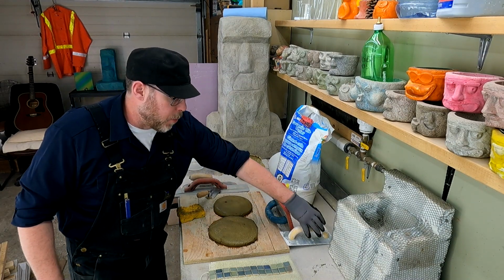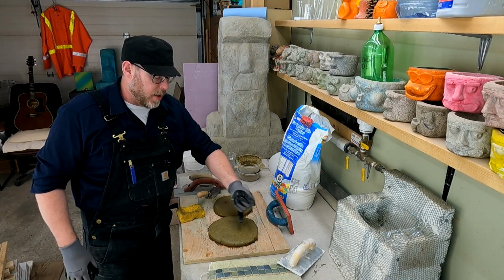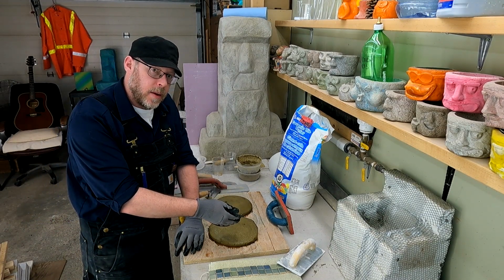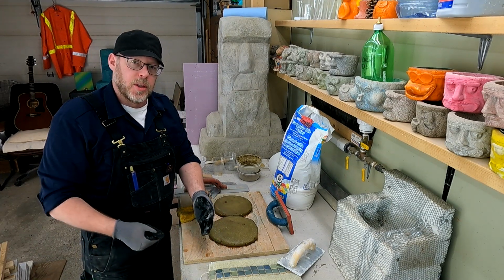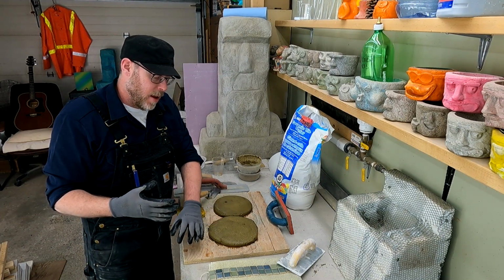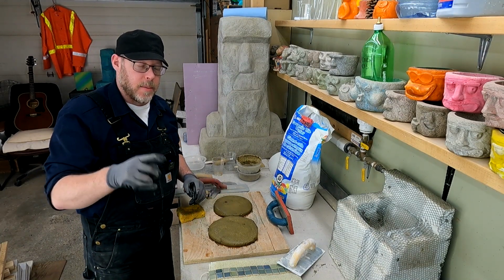And all that next step would be to take something like a sharp edge and just scrape it down and take down any of the high stones which are just a little bit too high. And at this point here, if I apply a thin set to that, I use my notch trowel. I apply a back butter to the tiles, which have been soaking in water and that now been patted dry, so there's no pooling water on the surface. And I apply those on there. They are going to last forever, provided that you don't grout it the same day.